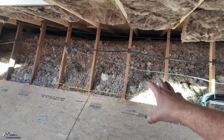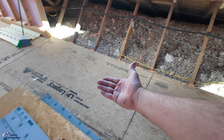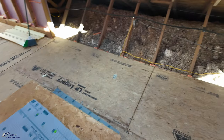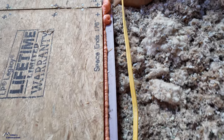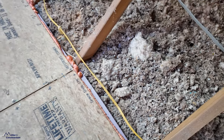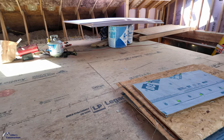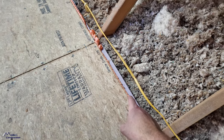Let me talk about what's underneath this subfloor. We've got blown-in cellulose insulation, and because cellulose settles over time I know there's going to be a slight air gap underneath. To remedy that, we installed rigid blocks of one-inch XPS foam, spray-foamed all the way around each block. Then after our subfloor was permanently installed, we ran a bead of spray foam to seal the connection between the foam and the subfloor, so hot or humid air from the unconditioned garage can't flow underneath our living space and disrupt our envelope.